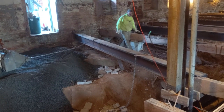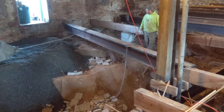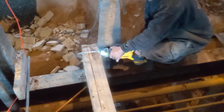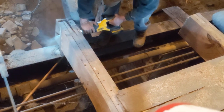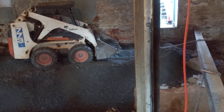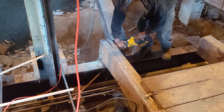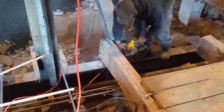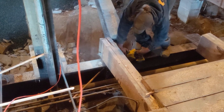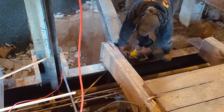Once all the structural decking was off the floor, a big part of this removal was pulling the floor joists out. Every other floor joist is a 3-ply 2x12, and in between those was a 12-inch steel I-beam with a 4-inch nailer bolted to it so you could nail the spikes of the structural floor into it, securing the floor above the I-beam. The floor was pretty stout — it pocketed into the brick on one end and then sat on a steel beam in the middle of the structure.